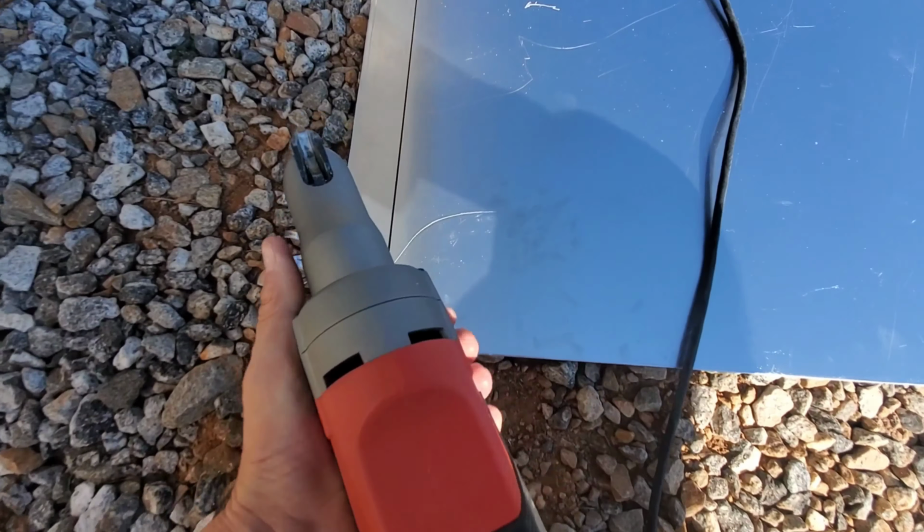Now here's my measurement. It's just going to be a strip. So it's 1¾ inches is the part that I want. So what I'm doing is when I pull my tape, I'm actually marking past the 3/4 mark. So 1¾ inches to the edge of that mark. And then that mark offsets the measurement. I make my line. And then when I take my shears, I'm actually lining this guide up over the line just like that to cut the line.